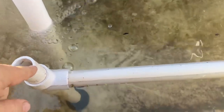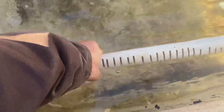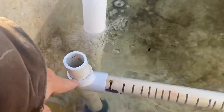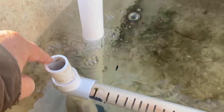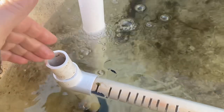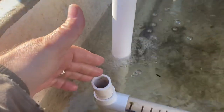These are my overflow apparatuses. This is your primary right here. I just took a chop saw and cut a whole bunch of slits in them so they're less likely to get clogged. This little stubby pipe here is a breather so it doesn't form a siphon, and it's also a secondary overflow. So if we get a surge for some reason, we have a full open pipe to handle the overflow until I correct it or until it passes - for instance, when we get rain off that roof, we're going to get a surge.